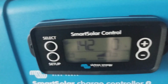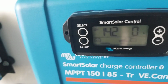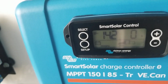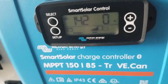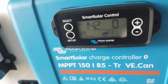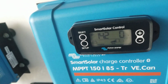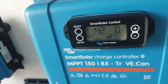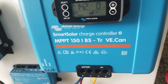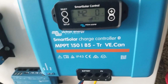and this one here is a mixed match panels with 50 watts, 4 of them. So 50 times 4, then I have another 83 watt module, 2 of them. So I wire them in parallel, the 83, and the 200 watts, which is 50 watt Renogy, in parallel as well, then series them because the voltages are identical, even though the other ones, the 83, are 21 point something volts.